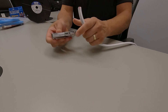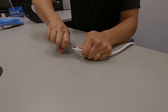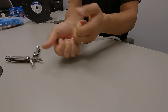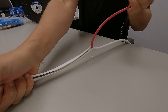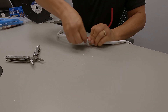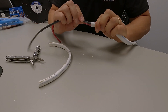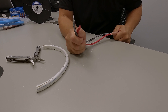Now I can expose that. With my pliers, I'll just pull that back a bit — you can use your fingers here as well, but you get a little more leverage with the pliers. Grab the tip of one of the leads, pull it out, and if you're able to pull it back along that score you made, when you get to your stop cut where we scored, it'll stop, and then you can just peel all around, just like that. Your outer jacket's off, and now we've got a nice clean cut on those wires with no damage to the wire internally. We can go ahead and put our connectors on — ring terminals or whatever it might be — to connect up our electronics.